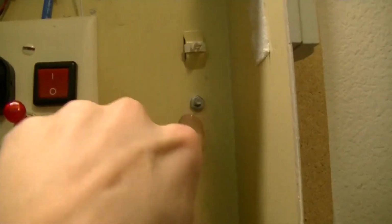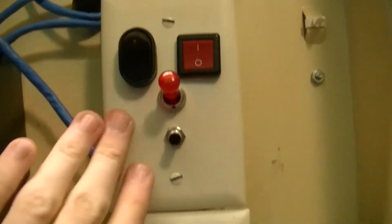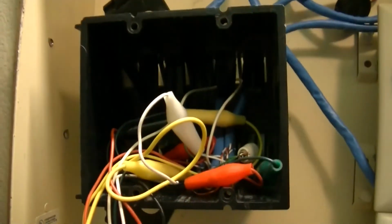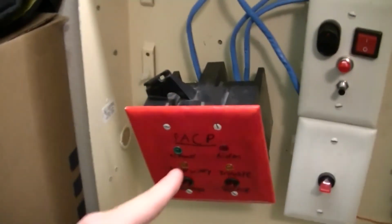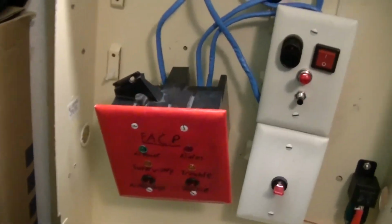But back in here, behind one of these lines, I don't know if I can show it. Yeah, there it is. That little glint of silver way back there is the screw that holds this to both the case and to the board. There's another screw hole back there that I used to hold this together. It's not bolted on to the chassis like these two are from the old power supply bolts. So these can stay intact. This cannot. So I'm going to have to pull this down before I can pull anything else out. Okay, so I closed this back up to hold everything in. I don't want to dismantle it if I don't have to, because it's a lot of rewiring to do.